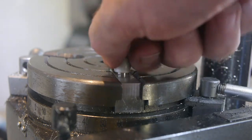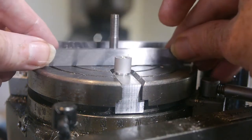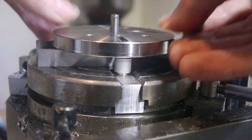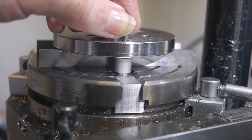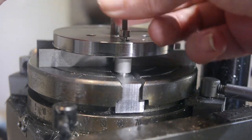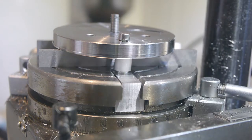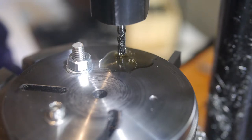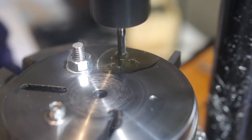The fixture would be more secure if the outer diameter was wide enough to clamp against the top of the table, but I don't have aluminium rod stock large enough to hand. In combination with the drawbar, that should add enough stability to make milling safer and may reduce chatter as well. You can see the final clamping arrangement here, with the drawbar through the centre of curvature as before, and a bolt screwed into a T-slot via the fixture in the equivalent hole on the other side of the plate.